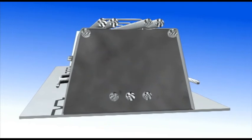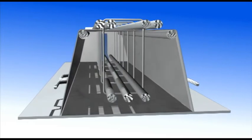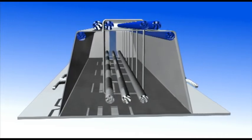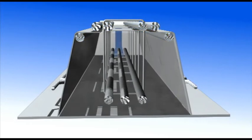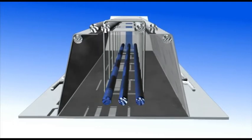The beam section is carrying loads together with the reinforced concrete structure. The bending capacity can be controlled by the use of rebars. Around the upper flange you can see the rebars, which will secure the bonding of concrete to the tubular steel section. The rebars in the lower section, inside the stirrups, are designed considering the needed bending capacity and fire safety regulations.